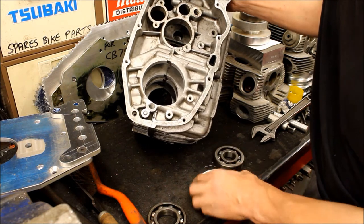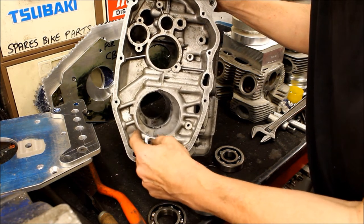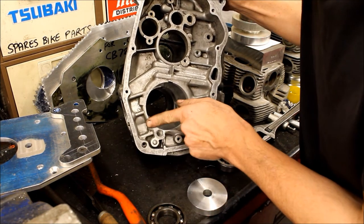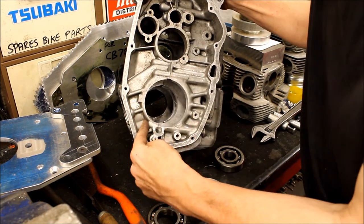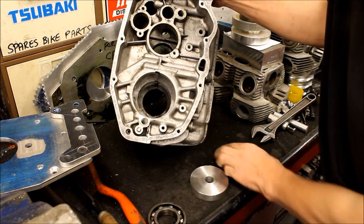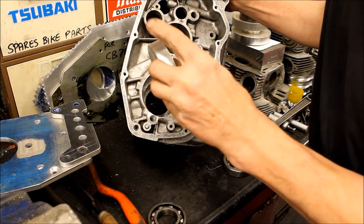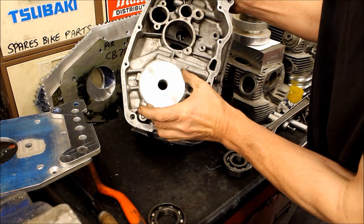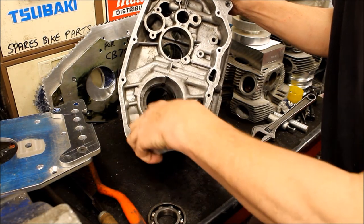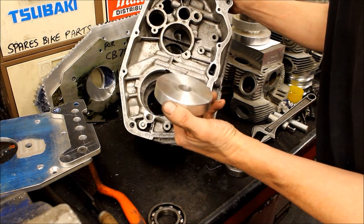So how are you going to do that? Well, because it's broken through into the stud there with only a minimal amount of thread, what we might actually do is with some special resin mix, mill that flat there, put a steel nut there and bond a steel nut into it just to help it. And we'll have to make a ring to retain the bearing so it fits still. We can mill a groove in there so it can't spin and it clears the bolt. There's no point doing it in steel since it's going into aluminium anyway — decent quality aluminium is good enough.